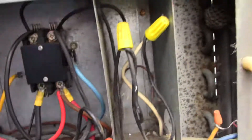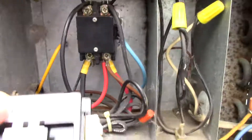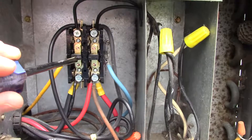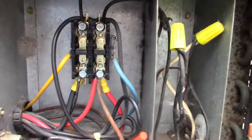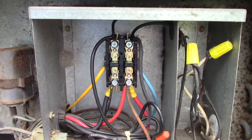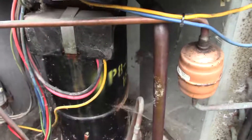So I've got to replace everything with the new unit here. This is an open type unit; this one's closed. The new contactor is in. This connects back in. Looking good. I'm going to apply power and she'll be back in business. She's on her own. All original parts except the capacitor and contactor — 1977 unit.